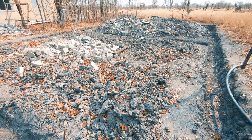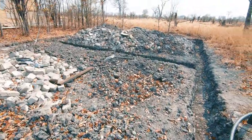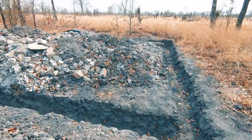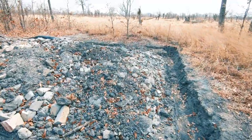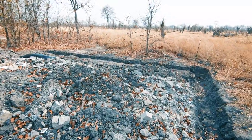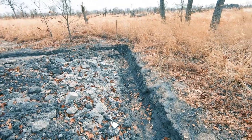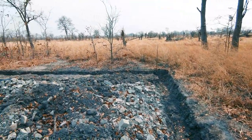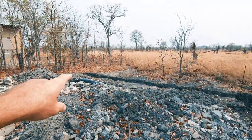It's going to be an open plan lounge and kitchen area and then through to the bedroom. Planning that the door will come here. It's going to be elevated maybe just short of a metre so that we get elevation and fall for the sewage and waste to go down to the left over there.